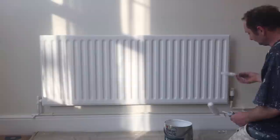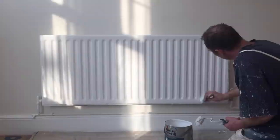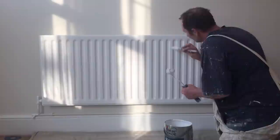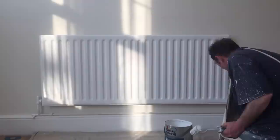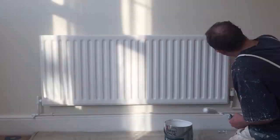So that's it, you see. Then you've got to lay it off, otherwise you'll just get an orange peel effect and you won't get the full gloss shine. So just lay that section off. Laying off basically means just running over with a brush. Cross that bottom like that. Just check that you've got the bottom of these mouldings here. Then you brush across. Simple as that.